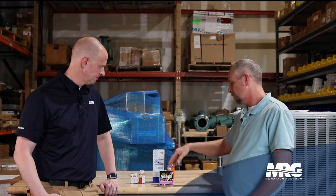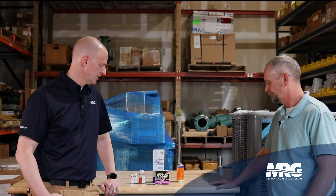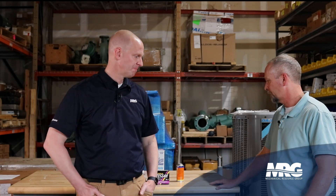So next step: we've put our dryers in, tested our oil, put our dryer in, put our acid scavenger in — always do a triple vac whenever you've got a burned compressor, because like I said, it could have been caused by moisture in the system. When you do a triple vac and do it right, you can feel good walking away knowing you've got every bit of moisture out of that system. Anytime you're changing a compressor — honestly, burnout or not — you should probably do a triple vac, because you just don't know what caused that compressor to fail. Always do a triple vac and you can feel confident there's no moisture in the system anymore. It can be a nasty job and a lot of work goes into getting it turned back around, but you sure don't want to just slap a compressor in — anybody can do that, and it's going to run for a couple of months, but it won't make it more than half a year if you don't do the proper cleanup on it.